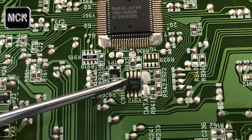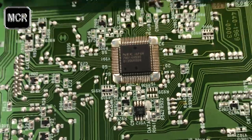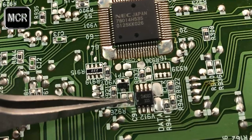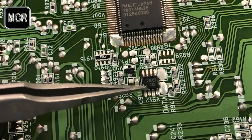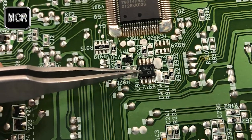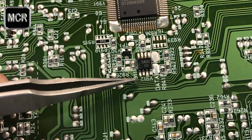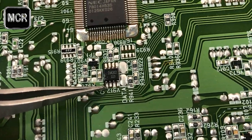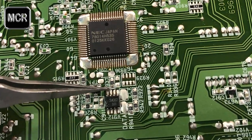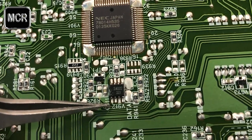When you take it out or when you're mounting it, just remember this as well. You look carefully here, there's a little cut right on this corner. You can see it from there. So before you take it out, just take a photo of it, and the digits are read from the back here. There's a little cut on this corner, and this is where you start reading the pins of the EPROM. So start 1, 2, 3, 4, and you go around the other way, 5, 6, 7, 8. So you read around like that, starting from here. So that's the EPROM for that one.